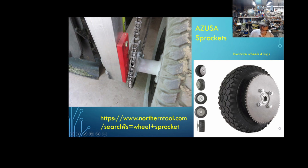Now, how I did there, what you can't see here, there's this 3/4 inch shaft. I welded that to this 1/2 inch by 2 inch wide piece of steel. I just didn't think anything I could do with aluminum was going to give me the strength for the bumps and all the stresses over the next few years. So this was a lot better system, I thought, and I used grade 5 bolts to bolt it to the frame, and it's really strong on this area where I bolted it.